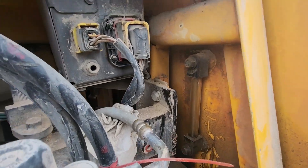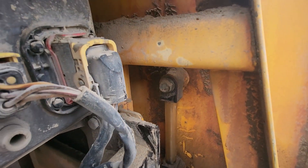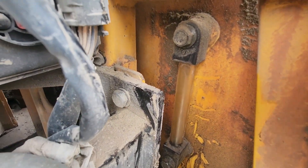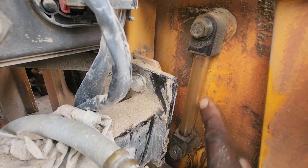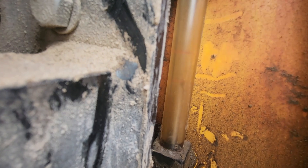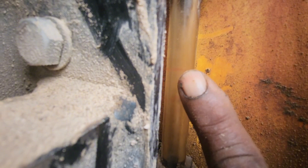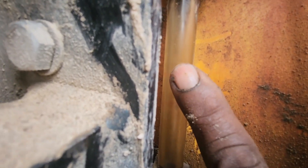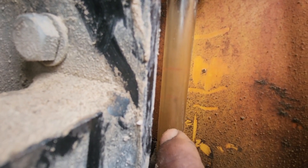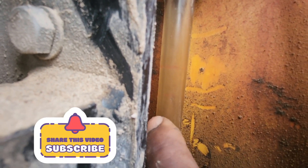In this same compartment right above — you can see this side because this is where the pump is, and the hydraulic filters are here also, and the fuel filters. If you look right here, you will see the sight glass, and it is empty. You can see it doesn't show any oil because the hose busted and it all came out. But you can see two red lines — one there and one there. When you fill it up, you fill it to the top line. You add again when it goes down below the bottom red line. As long as it is between these two lines when you check it, it's fine.